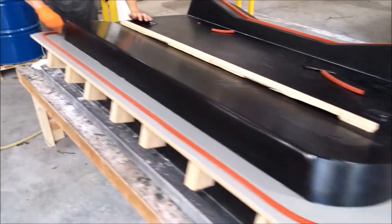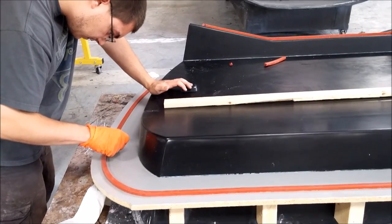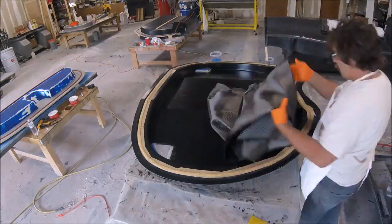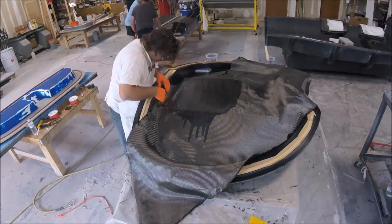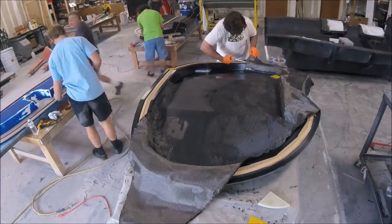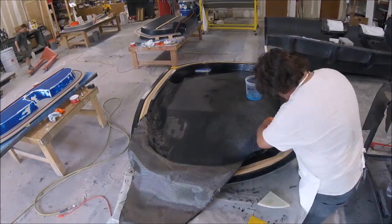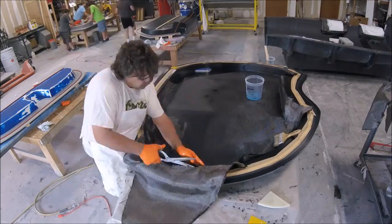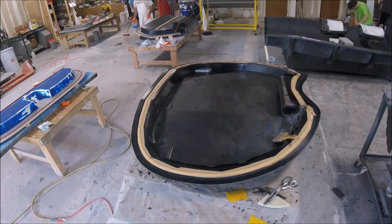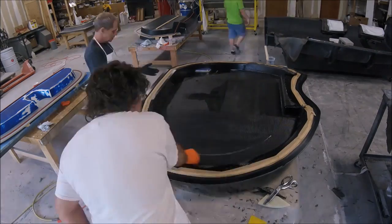Here they're doing the one for the actual upper aft pressure bulkhead - that's the one that mates up with the one you just saw. One is the lower half and the other is the upper half, and you'll see those pieces come together later. Next, Jeff was laying up the actual part for the aft bulkhead. On the time-lapse he's a fast worker, but not quite that fast. This is two layers of heavy fabric, then the core, and then two more layers of heavy fabric - so this is the first layer going down with resin being applied.